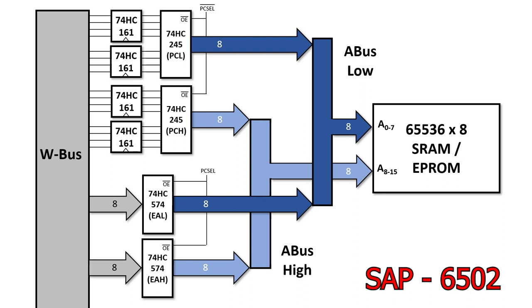To avoid contention on these buses, the program counter output enables connected to PC select bar, while the output enable on the effective address registers are connected to PC select. This change in polarity means that only one of the register pairs can drive the A bus at any one time. I also need a way of reading these registers back onto the W bus, but I think I'll save that for the next video.